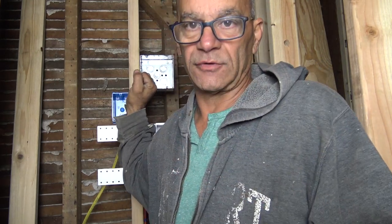But it's actually called the 10-3, right? Because we're not counting the ground. But you do need the ground. So we got a ground, we got two hots, and we have a neutral.